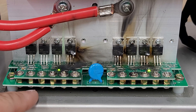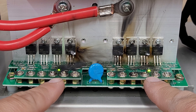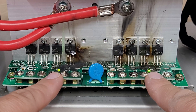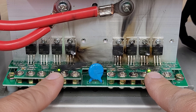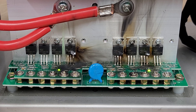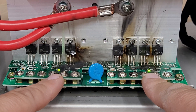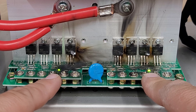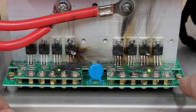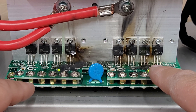For this example, I'm showing you because sometimes the seller will ask the customer to look for the green LEDs. If the green LEDs are there, it means everything is fine. Obviously you can see here that everything is not fine, which would conclude that these green LEDs really don't mean anything. This particular inverter suffered some kind of overload that blew all the FETs out.